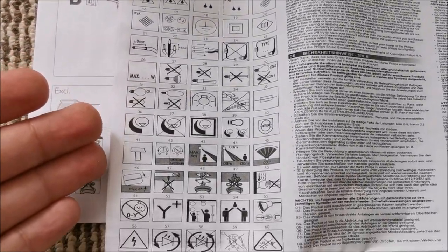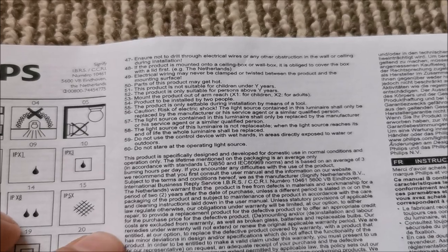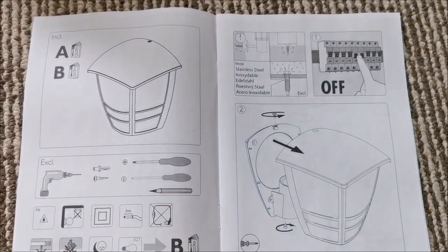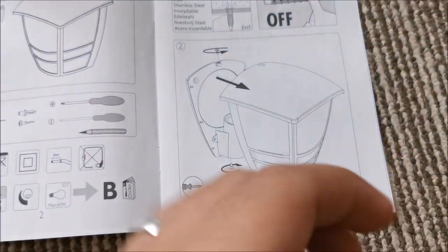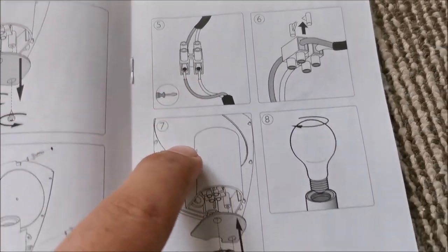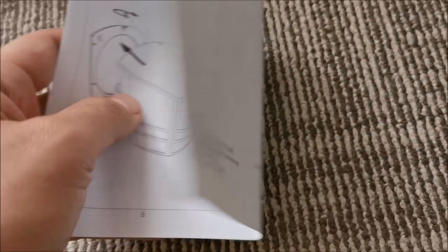Here we have the safety warnings for presumably a hundred types of these things, because we also have something for all kinds of sensors and who knows what — this obviously doesn't have that. And if you want to read the text, feel free to bore yourself. These are the instructions for installing this. I'm not going to go into too much detail because it's quite simple: you shut off the electricity from your fuse box, remove the two screws — top and bottom only, do not touch the others — and the whole front will come out from the back. Then we remove the bottom part, mount everything to the wall, do the wire attachments in the bottom part, put in a light bulb, and put everything back together. So quite simple — let's get to it.